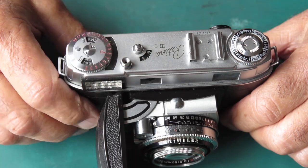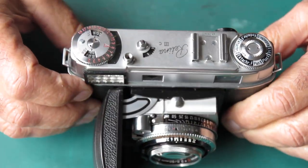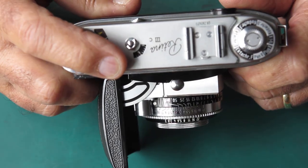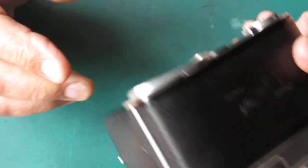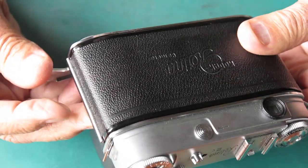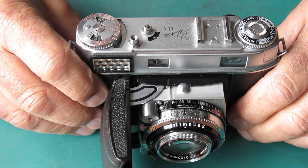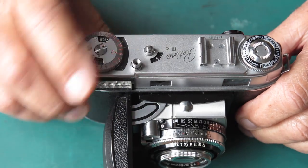What happens if the shutter release is adjusted the other way, so the first action releases the shutter but doesn't unlock the film advance? That's very frustrating - it's much better to have a blank frame on the film that you don't know why, than to have a situation where you cock the shutter, take your photo squeezing gently on the shutter release, and then release your finger only to find the film advance hasn't freed up. Normally you'd press the film release button to wind on, but that's an extra action you don't want. Ideally the shutter release and the film advance release should happen at exactly the same point in the travel of the shutter release button.